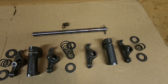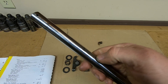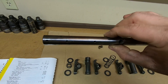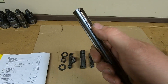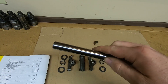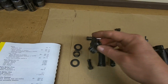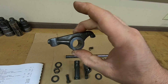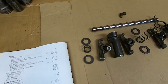I've got everything cleaned up - it was dirty but I'm pretty happy with how everything looks. Not seeing anything for wear on the shaft. I was worried these things had been starving for oil; I think they'd been running a little bit dry, but everything looks really good. I can't pick up any noticeable wear on the shaft when I measure it - no galling, no scoring. There are a couple of old witness marks; looks like some corrosion had formed in there from the years this thing's been sitting, and I'm thinking that's where the catch was I was feeling when pivoting that rocker. Now let's check clearance of the rockers on the shaft.